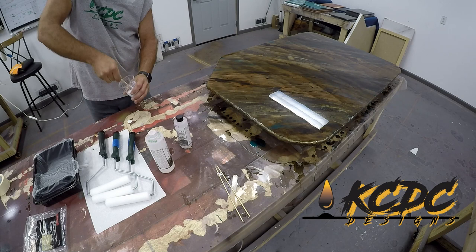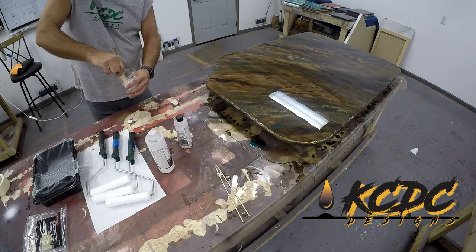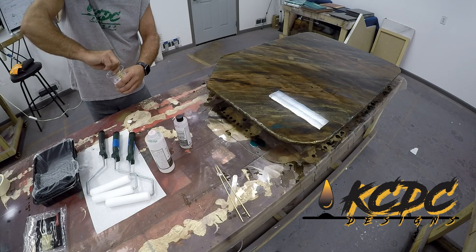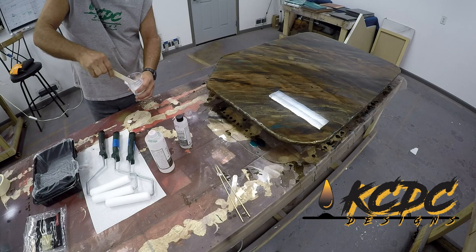While I'm mixing this up, it seems like the struggle that most people have with the Ultimate Top Coat is roller marks and/or lap lines. To me, lap lines are an excess amount of product that comes off of either end of your roller, whereas roller marks are being able to see the pattern of how you rolled on the product with your wet roller after it's fully dried.